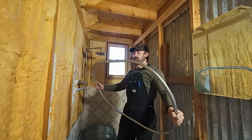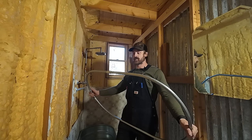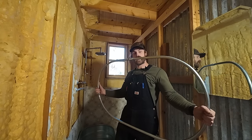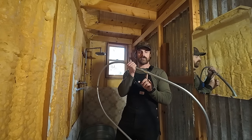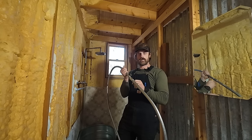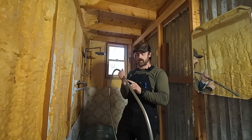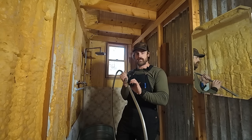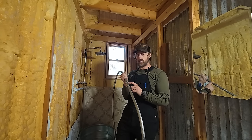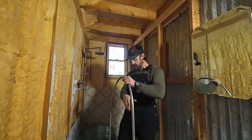In any case, I didn't think that was gonna work. After I broke the bender on the first attempt at bending, I'm like, crap. But we got her together, and then I just took the original coupler. Can't remember what these are called. I think they're like trade couplers or something like that. They don't have a set screw or a grub screw or anything like that. I threaded it all the way onto one end and then butted the other one up and lined them up and essentially tightened it up to this end as well and loosened it off the other end, right? It makes sense because it's not opposite threads. It's pretty solid.